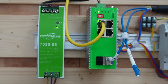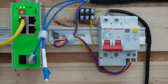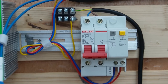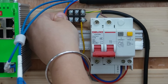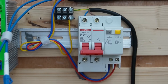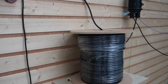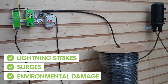And then let's talk about power. This is the power supply for our industrial switch. Now, for our composite fiber optic cable, we have an AC outlet connected to an air switch. Make sure to follow proper grounding procedures, and always use outdoor rated equipment for maximum safety and durability. As you can see, the positive and negative power cables are connected to the air switch, and the grounding cable is grounded through here. And next up, we are going to run our composite fiber optic cable. You'll want to make sure your cable is properly protected against the elements, as outdoor networking setups face risks like lightning strikes, surges, and environmental damage.